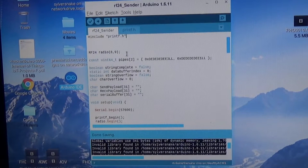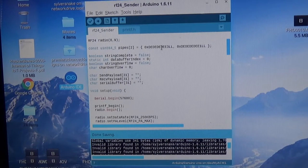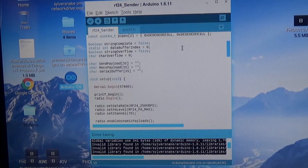We're going to set up our radio on pins 8 and 9, then set up our pipeline — we'll use two pipes, one for send and one for receive. You can do multiple pipes for sensors, temperature, humidity, different things. For the channel addresses, I came across this approach a long time ago: I just change these numbers, like the 3 and the 1, if I want different channels for radios on different pipes. Leave everything else the same — I've been using it for quite a few years and it works really well.